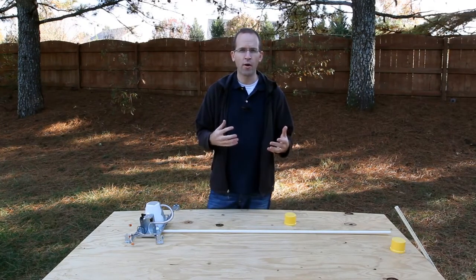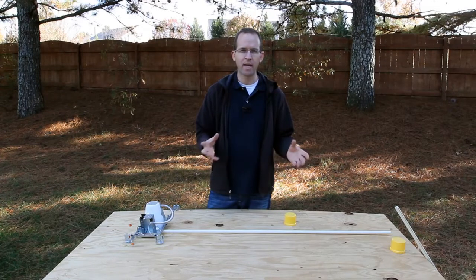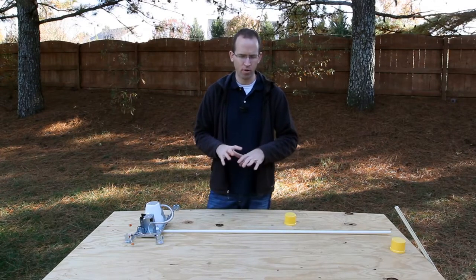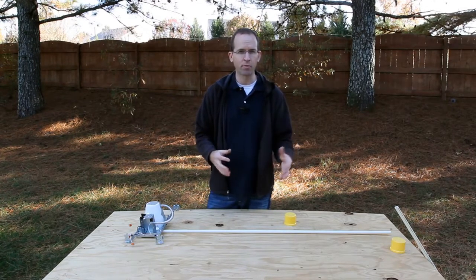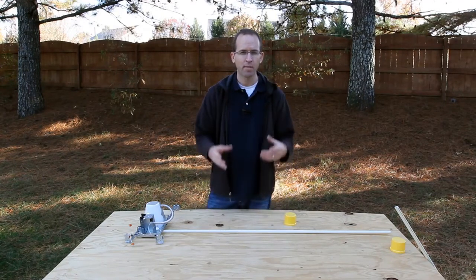In a conventional 14-2 wire, you've got two wires plus the ground. The ground and the common — the white wire and the copper wire inside the sheath — are going to be common or consistent with all my examples. So I'm just going to focus on the hot wire. We're going to pretend that this is the black wire and it's the hot wire.